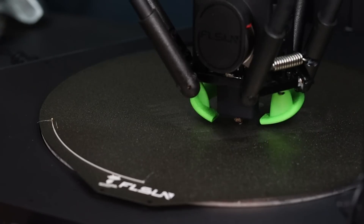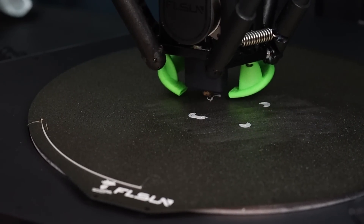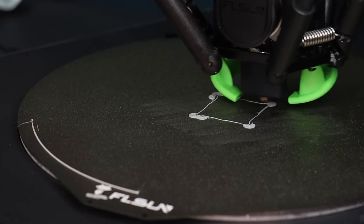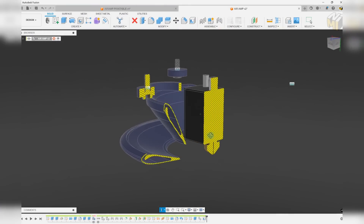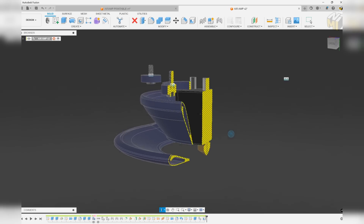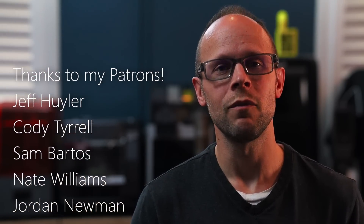As far as 3D printing is concerned, I think there is some value here. In the case of part cooling we don't have much air out front to entrain, but we do have a lot of air from around for induction. So the next step is to use what we've learned to produce a part cooling fan duct and test it out — make sure you like the video and subscribe if you want to see that, and let me know what you think. Thank you to each of my patrons for your support and for making videos like this possible — take care and we'll see you on the next one.